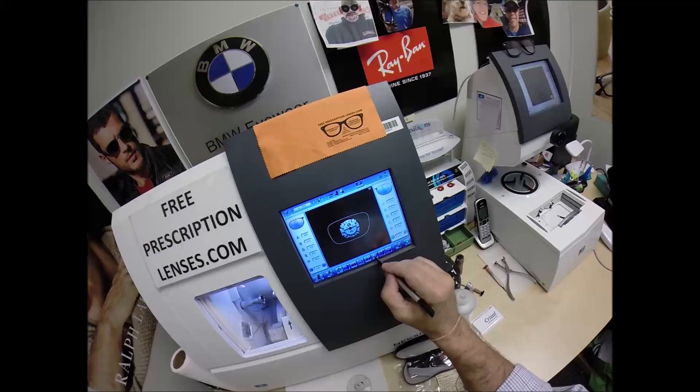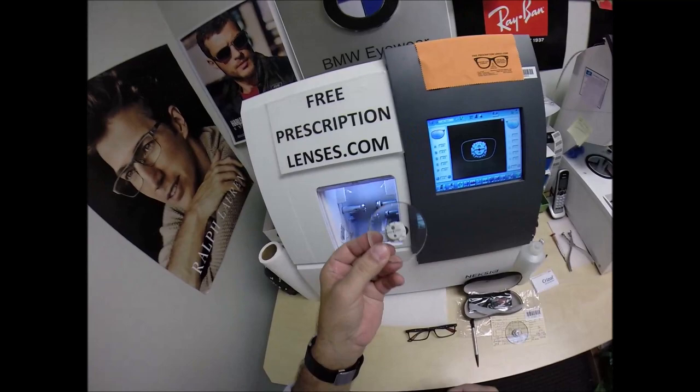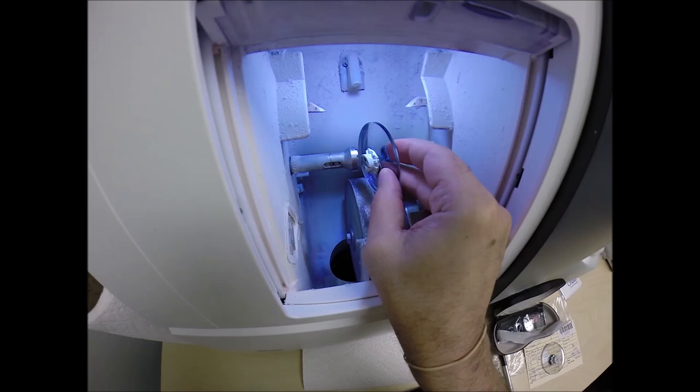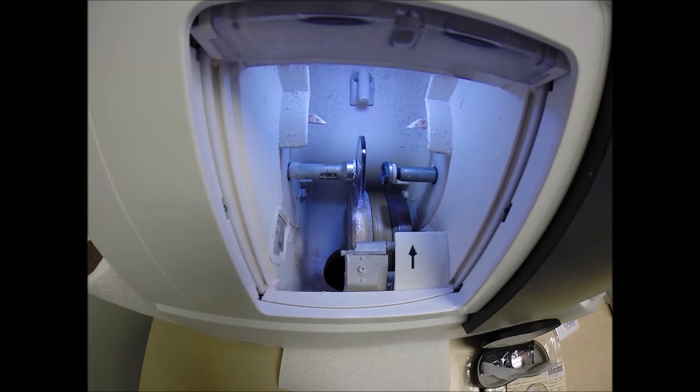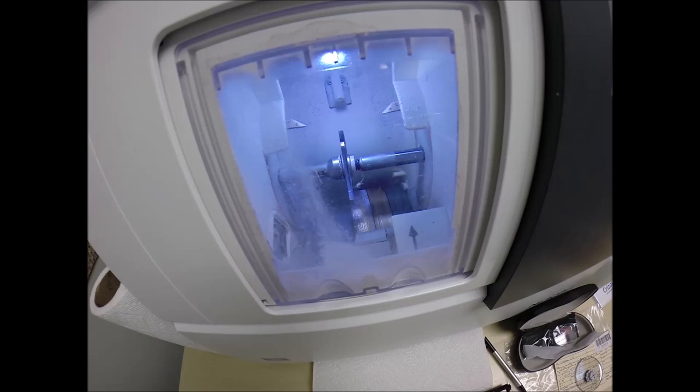See the little hand? I'm not going to polish the edge of the lens. I'm not going to put a safety bevel on the front convex surface of the lens — I'm only going to put a light one on the rear concave surface of the lens. I'm now going to press the block — the Jenny from the block — onto the lens firmly. The magnet's going to do its job twice: attach itself to another magnet there in the chuck, which I like to call the Charles. Hit the green arrow, which is start in every language. The door closes, the clamp shuts. The lens is going to be traced by two white styluses.